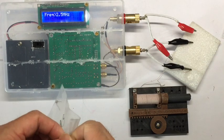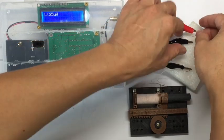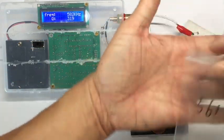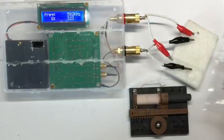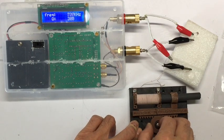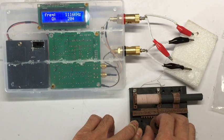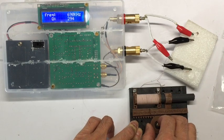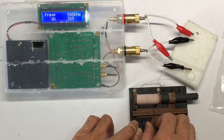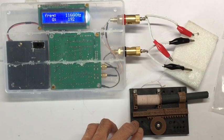Now I'm switching to the lower band using a larger fixed capacitor — 560 pF, also the high-Q 10,000 Q SMD type. When it's all in, the Q is around 315. When it's all out, Q drops to around 200. So we're seeing 315 to 316 all the way down to around 192.